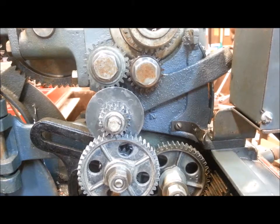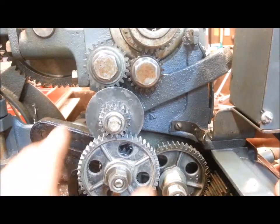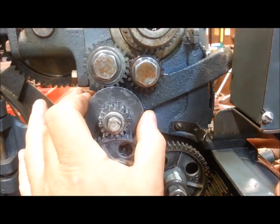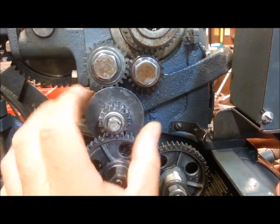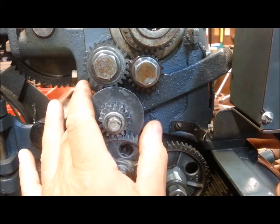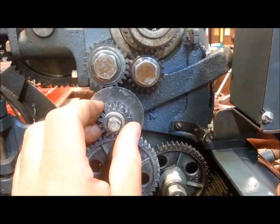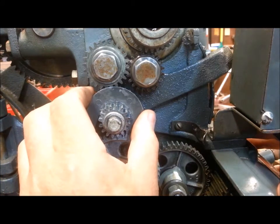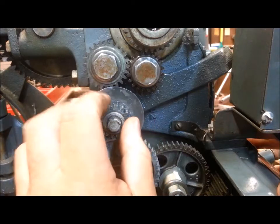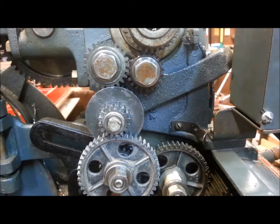We're beginning the next project on making the lathe gearbox run more quietly. This gear was very sloppy in the bore and I borrowed a gear off of another lathe. I plan on bushing the gear that came with this lathe and making it nice and tight like this one is. This was part of the source of my noise and we're going to look at another part.